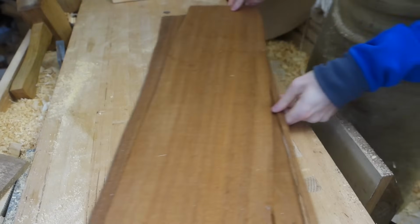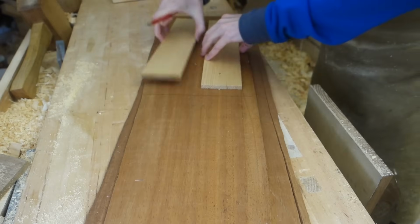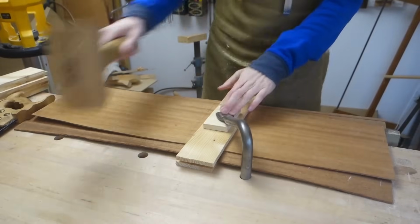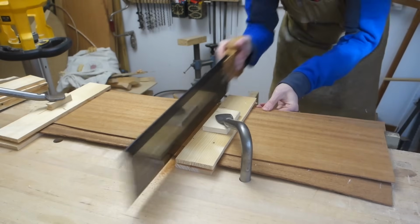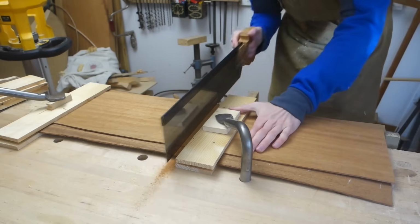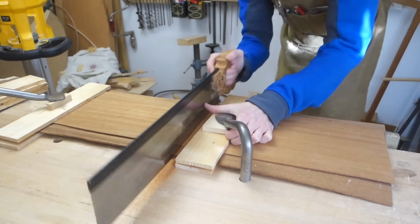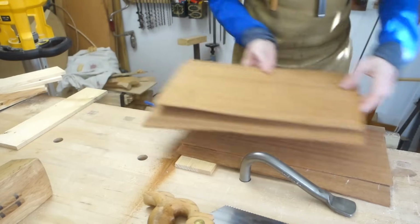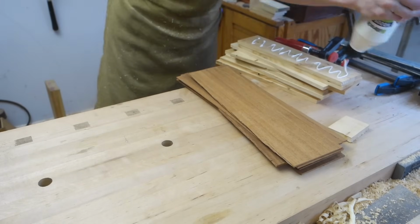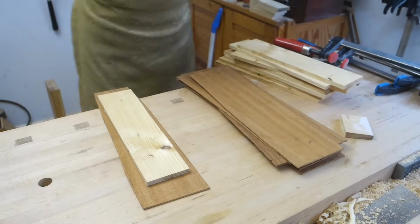After planing, I laid out the parts on a sheet of thick reclaimed veneer. I decided, since the outside of the tables will be painted, I wanted the exposed wood to be something a bit nicer. A mahogany surprise when you open the drawer. I glued these veneers on with plenty of excess all around to be trimmed after drying.